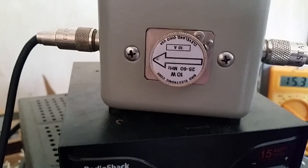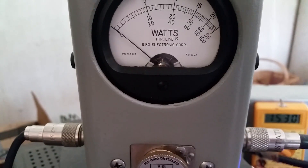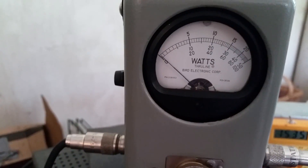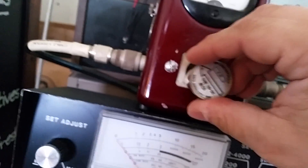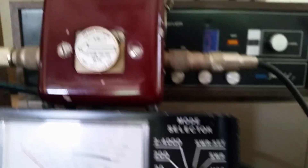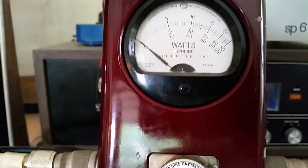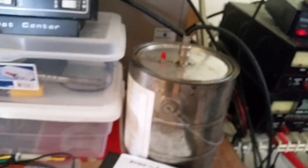Alright, I ain't got much time, let me speed through this. We're looking at your output reflect — output SWR as some would call it — because it did have a lot of it. Turning the box on — beautiful, hardly any movement at all. I'm gonna take that off and pop the 10-watt slug on the input because it had almost three watts of input reflect. Now let me show you the input — beautiful! It was going all the way to three watts when I first started, so that's good, man. It's about 250 milliwatts now.